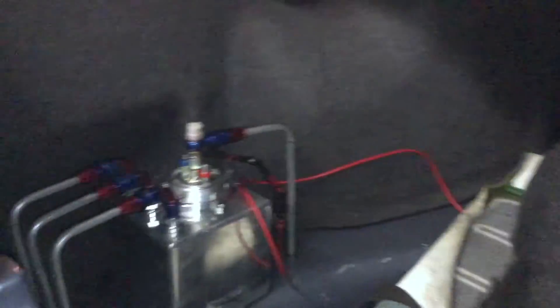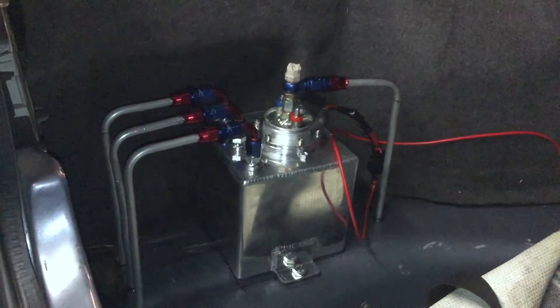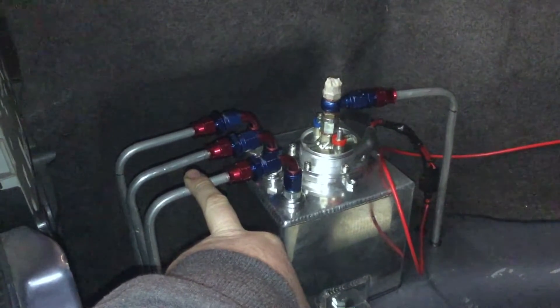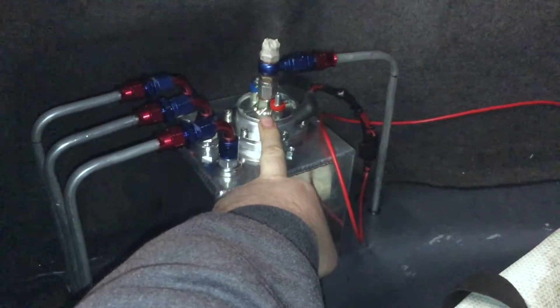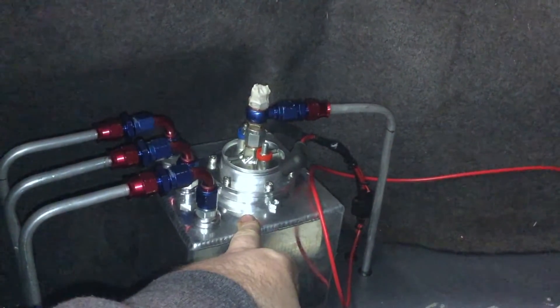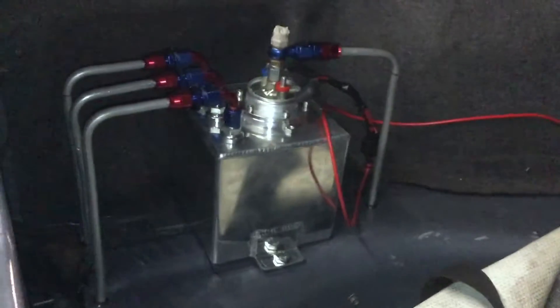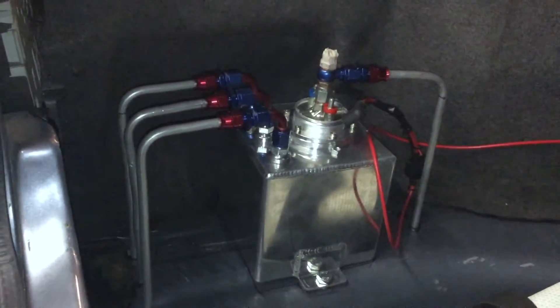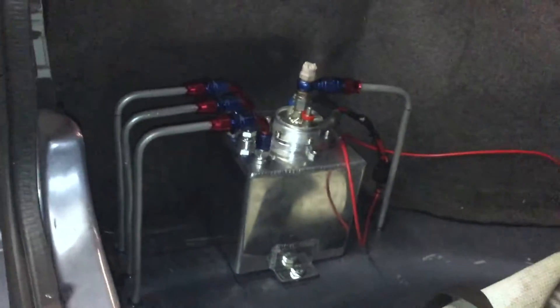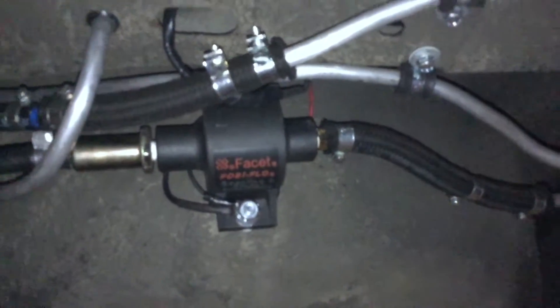So I had to come up with a solution. My solution was to fit a swirl pot or surge tank in the boot, which has been done — so here it is in place. I have two feeds here from the petrol tank, being fed by a smaller pump underneath the car. Then I have a high-pressure Bosch 044 knockoff by Automotive Plumbing Solutions — I'll link them in the description. This is just a temporary knockoff pump just to get it up and running; I'll get a proper Bosch one in due time. The other helper pump is the little Facet 60107 — you can see the fuel lines going up over to the tank.